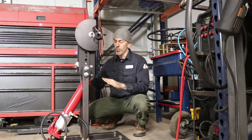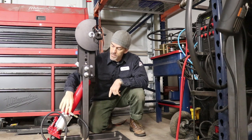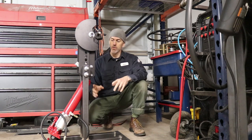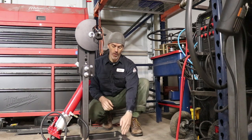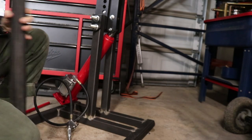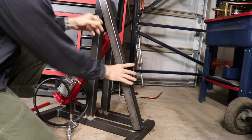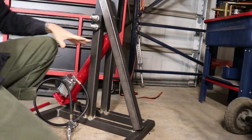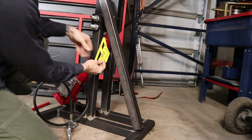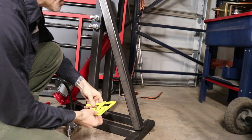My next step is to reinforce. I want to triangulate this thing — ideally on one side, but since that conflicts, I'm going to triangulate it on the other side. To figure out what angles I need, I'm going to use this little angle finder. I've got another piece of tubing to give me a rough idea. I think I need like a 60-30 angle — and that looks like it's about a 60-degree angle, same down here.